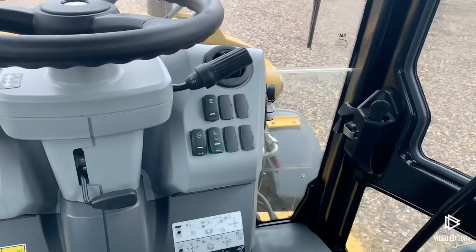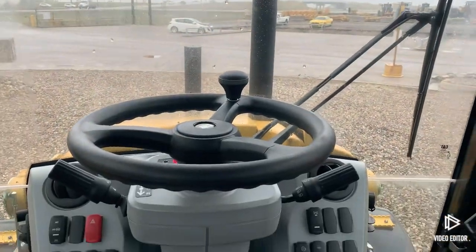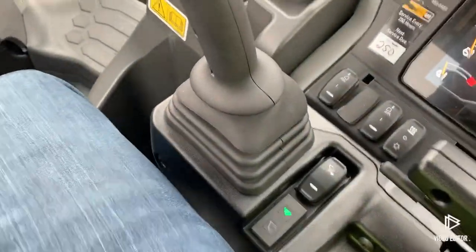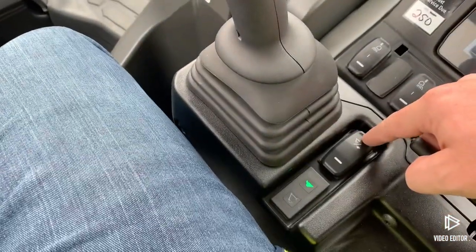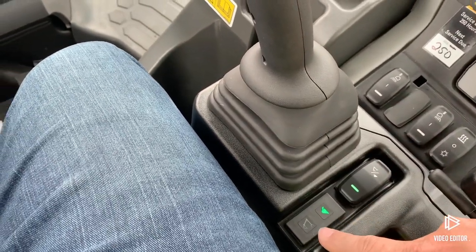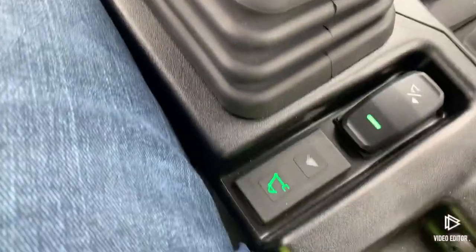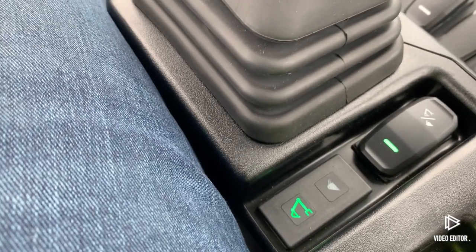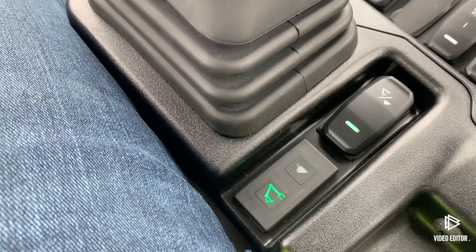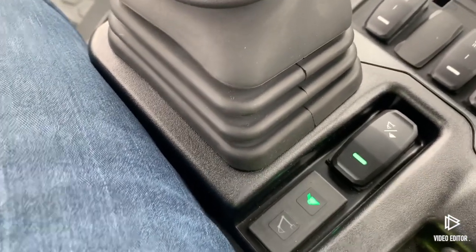Now what if I'm facing forward and I want to run my backhoe while facing forward? Dual mode gives you that same functionality. Right now we're facing ahead, so the only light illuminated is the loader bucket light. When we enable the dual mode switch — it's lit up green again — now when I press the left hand trigger on the back of the left hand joystick, you see it switches from loader bucket to backhoe. So while I'm facing forward and holding the trigger, I can run my backhoe. When I let go of the trigger it goes right back into the front end loader image, so my controls go back into running the front end loader.